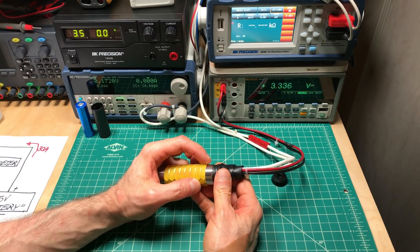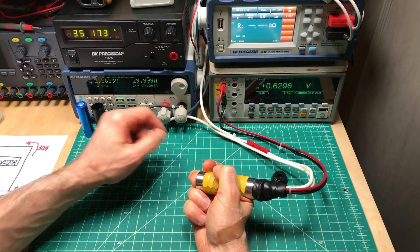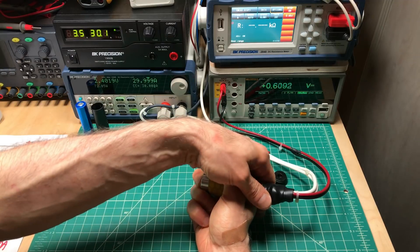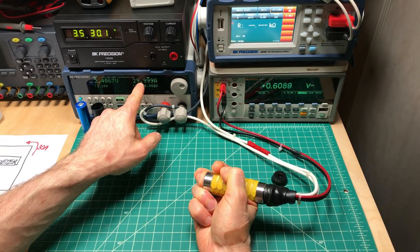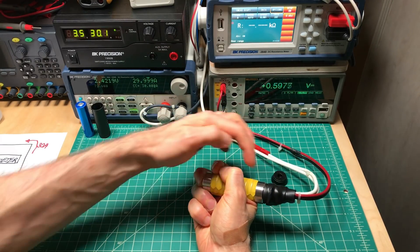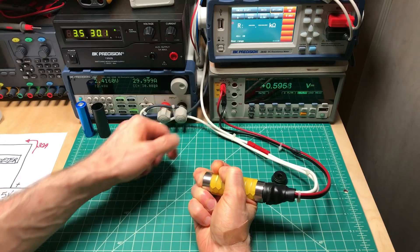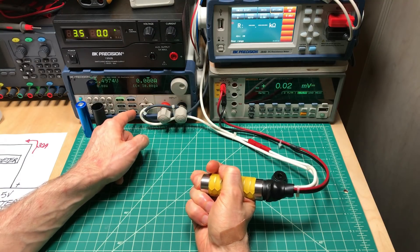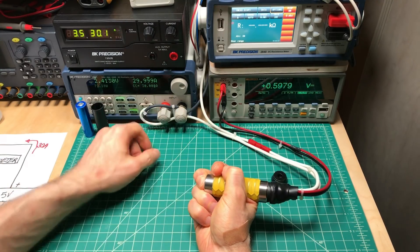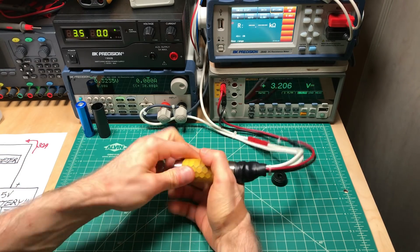I also found that during my tests this would suddenly feel loose. With 30 amps flowing — 29.999 amps — we're back up to 0.5, 0.59, 0.6 volts. I think this is expanding from the heat because it starts to heat up. That's why I like this setup — the coil heats far more than the mod. Let's try again: 0.58 volts.